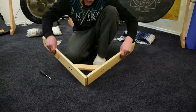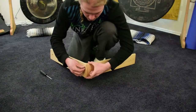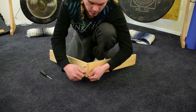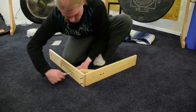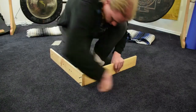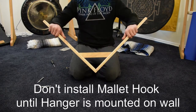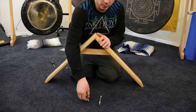Now that the small piece of wood is lined up with both side pieces with just a little bit of play, take your two larger screws and line them up so that the boards connect to each other. Once they're hand-tightened, go around and finish tightening the smaller screws into the brace piece, then tighten the big screws fully. Here's your built Great Wall stand — a nice solid 90 degree angle. In the next video, we'll discuss how to install this stand using the wall anchors.